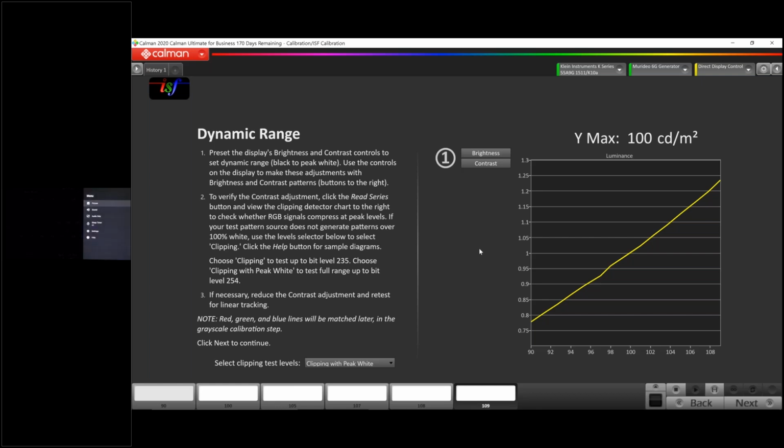If I turn the brightness up to, let's say, 60, and now all of a sudden I can see the boxes, that's great, right? But what you might not see in the camera, and I don't think you will be able to, I'll go to an extreme just so you can really see it. If we turn the black level up or the brightness up too high, now the background is gray. The background is supposed to be black. So what happens when you're looking at something that's supposed to be black and it's really a dark gray or even a light gray? Think of a black t-shirt that you might own or black jeans, and you've washed them over and over and over again. They start to look kind of gray, and that's where we kind of get the term washed out, right?